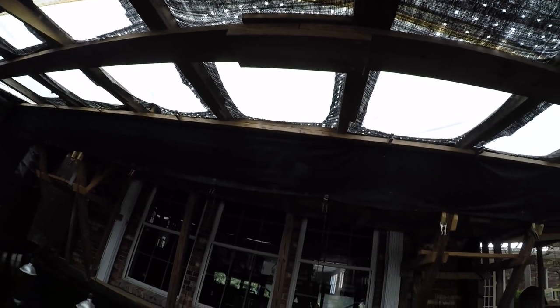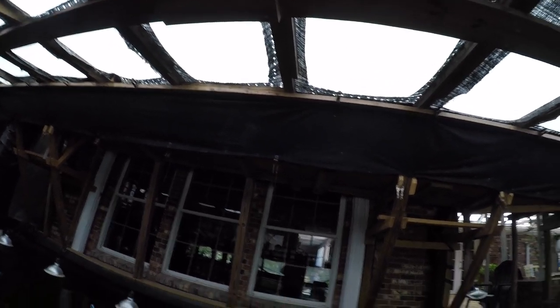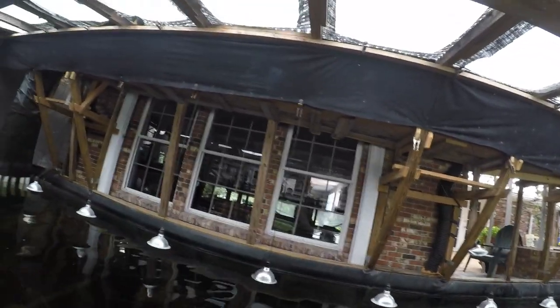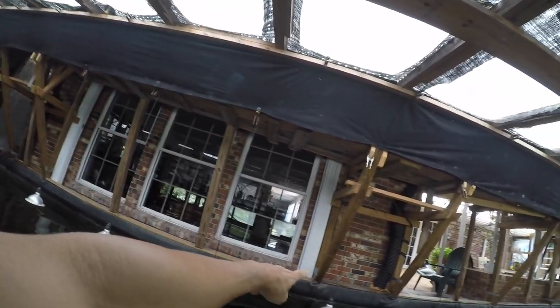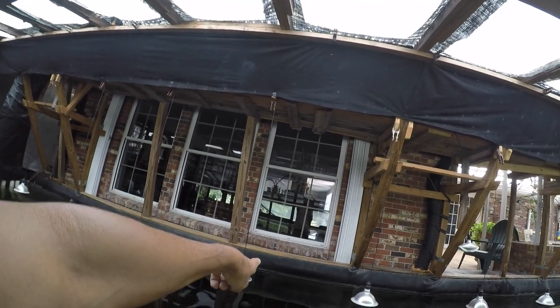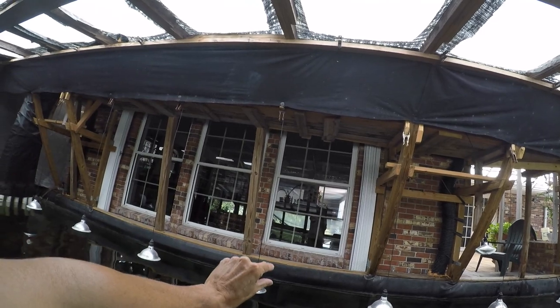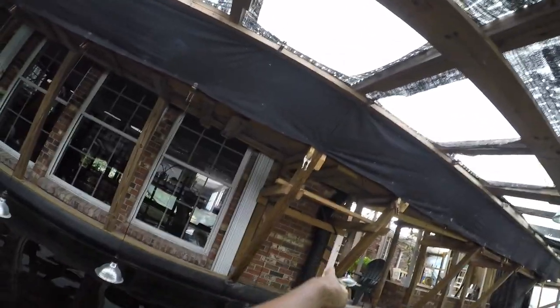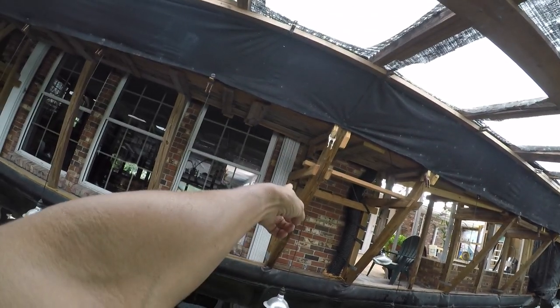The aqueduct rests on those vertical, angular, slightly off-vertical posts on the pond. And the pond has poles that go down 3 feet in the ground, 4x4s. You don't see them because they cut right by this board. The white board lays on top. There's another 6x1, and then between the two 6x1s is the rubber. So there are two 6x1s that lay on top of the 4x4s, each 4 foot. And then these poles are attached to it, except for those two. Those two go all the way to the ground, and they're embedded 3 feet in the ground. But they're under the overhang, so they don't go up. Only the angular ones go up all the way to the rafters.